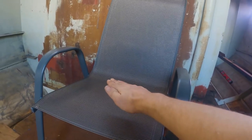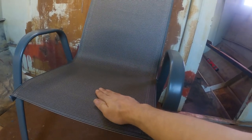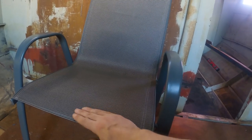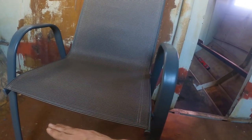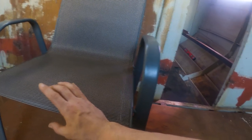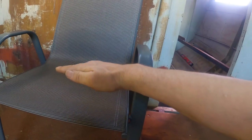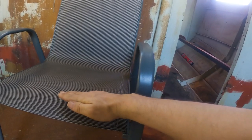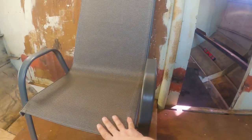So that's probably good. Now the challenging part will be, this is where your bum height's going to be. However, there's going to be a cushion, and as you sit on that cushion, it needs to depress to about that size. So I've got to take that into account. So this isn't going to be the bottom of the settee. The bottom of the settee will have to come down, work out sort of the density of foam that we're going to put on there. And the foam's probably going to be that thick and needs to depress to about there. So lots of things to consider. But I'll figure it out and we'll get to welding some steel in.